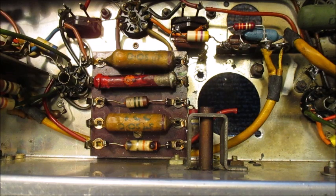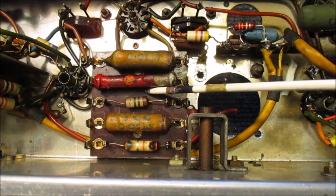I'll crack on with checking and replacing components on this tag board. Having checked the strength of this 47K grid-1 stopper resistor, it incidentally gave a measurement of 48.9K. Messrs Bush Ltd. may well have bought in a cracking good bunch of 47K half-watt 20% tolerance carbon resistors on that occasion.